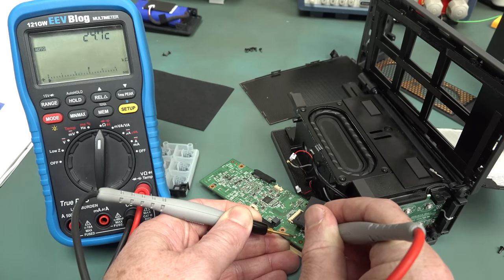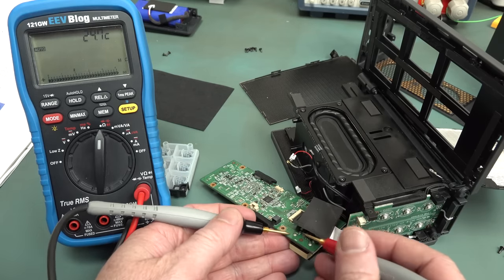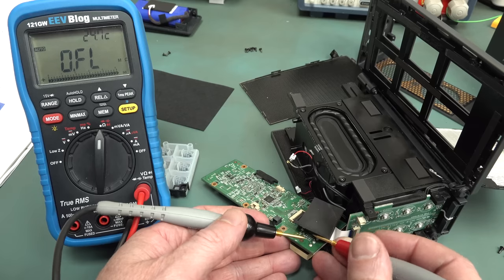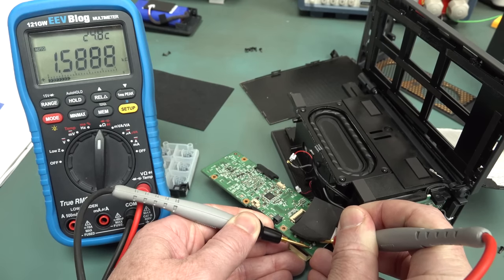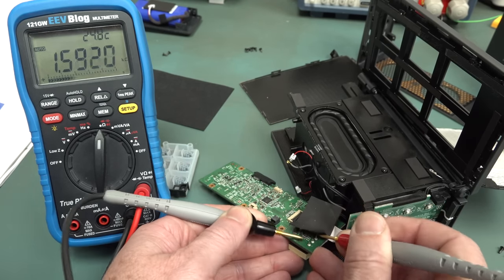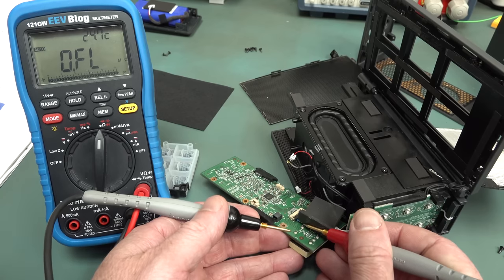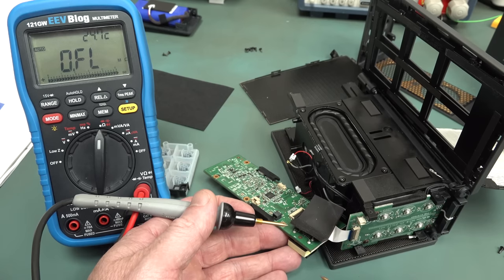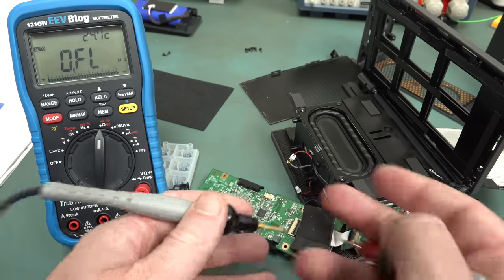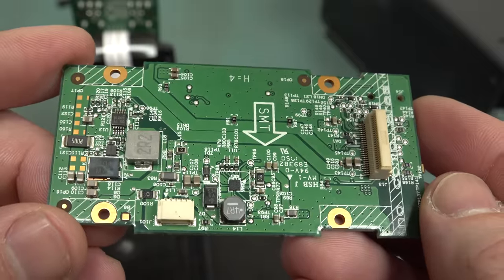So this is the primary side - 1.1 ohms. That's low, so it's a grunty little driver they're using there - that little ball grid array, tiny thing. And the secondary - one and a half K. So yeah, they're stepping up that about a thousand times. Out of one volt drive level, you'll get a thousand volts differential drive across your two grids as a differential. And they're just using the diaphragm connected to ground. They've inverted the topology of your regular electrostatic implementation - and it works for them. For those who want to see the other side of the charger board, the case ground is connected to the USB ground. You can see there's a little NFC antenna up there, and that front board just has the switches and a couple of LEDs. That's all very nicely integrated and designed.